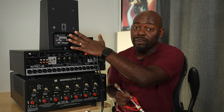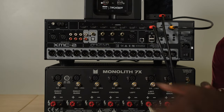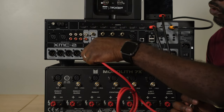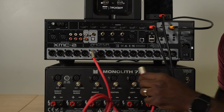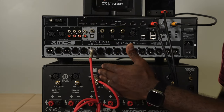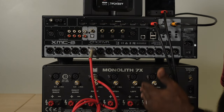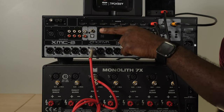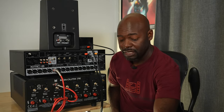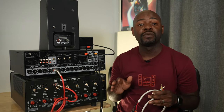This is going to be my front right speaker in this example, so I'm going to find the right front output on the processor, plug the balanced cable in there, and then find the right front input on the amplifier and plug it in there. On this amplifier, everything in this row is right channel, this row is center, and this row is left. Now that I have a connection between my surround processor and my amplifier, I need to make the speaker connection.